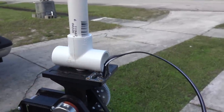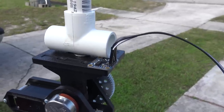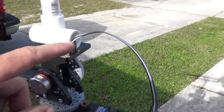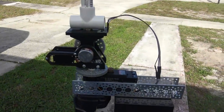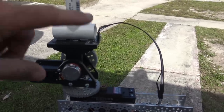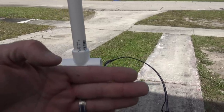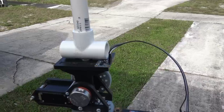This is your up, down, left, right orientation sensor — an accelerometer/gyrometer — that detects what's up, what's down, 180 degrees, and so on. That's connected temporarily with a breakaway connector because if I wanted to take this thing apart, I could disassemble it without cutting wires. This board needs to have its short side parallel with the boom, connections facing the back, and all surface-mount devices facing up. I met those three criteria — that's how it's mounted.